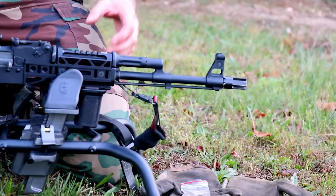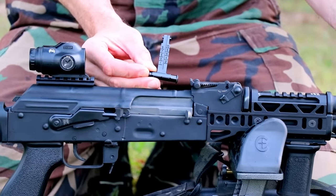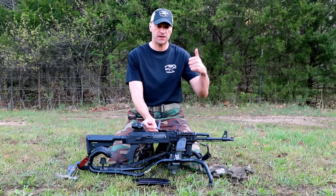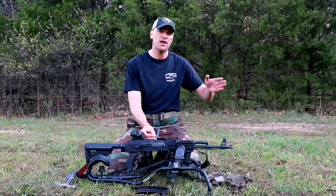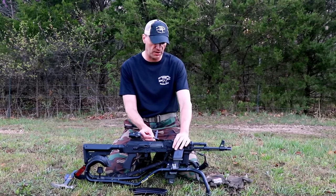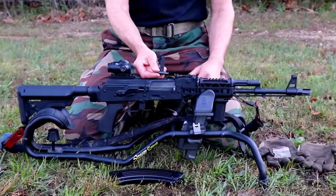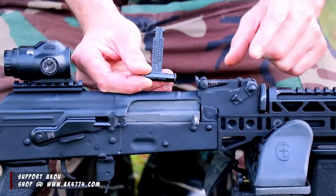This is a great solution not just to cure what you have out of the factory, but also when you're trying to zero the rifle and running into that front post drift — having to drift it all the way to one side. Sometimes you have to adjust the front post because of different muzzle devices, especially on Wolverine suppressors — the point of impact changes, the ammo is different, whatever it is. But when you have those rear adjustable leaves, they work very, very well.